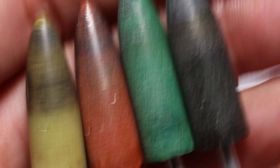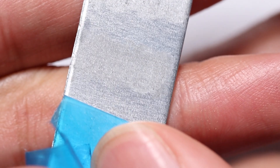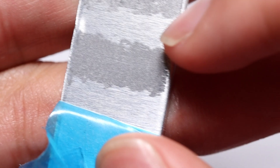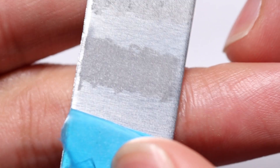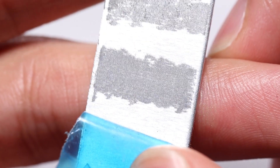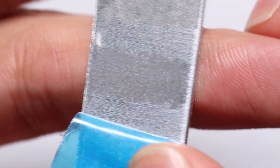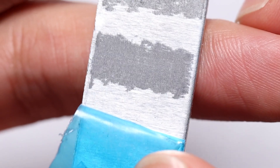If we have a look at a couple of the other metals - the comment in particular was interested in aluminium. Here you go. Really coarse, I think too coarse for anything unless you're trying to get rid of some welds or something. And then if we transition all the way through to here, so this is the polished untouched surface, that's the 1500. I don't know if that's what people were after. I think sandpapers are a little bit better on the aluminium surface - it's just a little bit too rough. I reckon I wouldn't go over that with the cloth and polishing sticks.